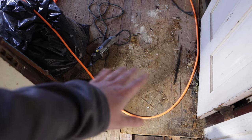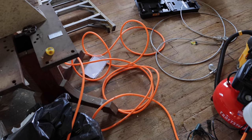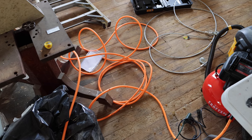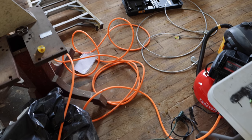So a transition piece. And this flooring is going to be something different because this pine flooring would have never been exposed in these grander rooms, especially in this room. This is one of the nicer bedrooms, so this floor just wouldn't be in here. It wouldn't be part of this whole thing. So I think I'm going to put oak on top of it, like thin strips of oak, and top nail it because that's actually what they did in the parlor downstairs. So it will match.